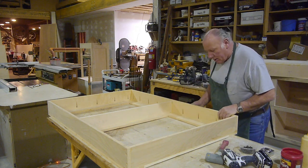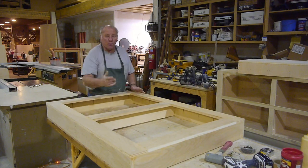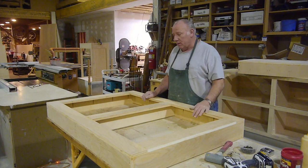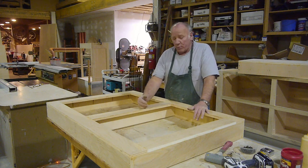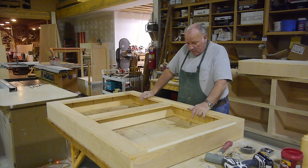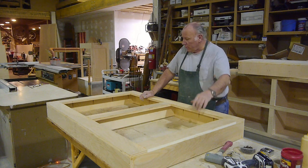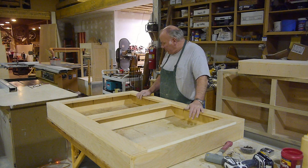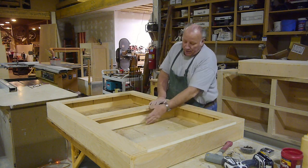This is looking good. The centerpiece here - you notice it's up off the floor. This is going on a tile floor and I'm going to have to scribe it. This doesn't really need a lot of support; this one is really to keep these sides from bowing in or out. The rest of it wants to sit on the floor in case there's something uneven that we can scribe it, and we don't want it rocking on the middle piece underneath.